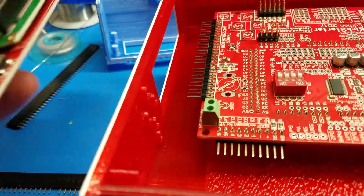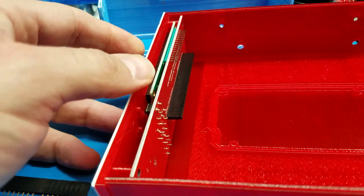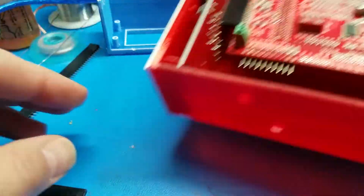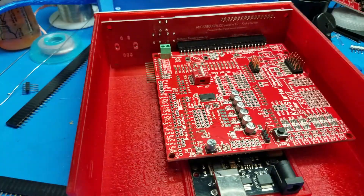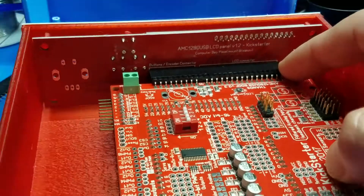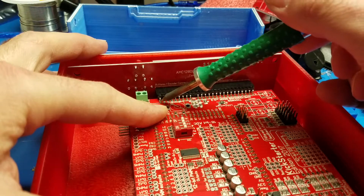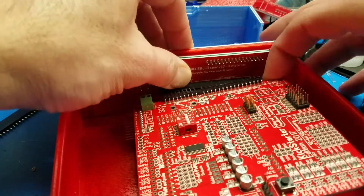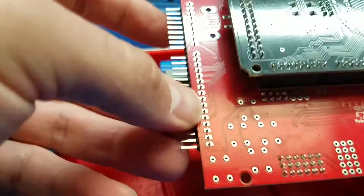There's a little clip on the back of the LCD, on the front panel. It's not soldered yet, but just to show you how — you place it before you solder it like this, press it all the way down, make sure it sits, and then you solder those pins. You can solder one in the middle first, then lift it and remove it to solder the rest upside down. This keeps it aligned correctly for the distance.